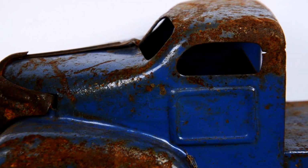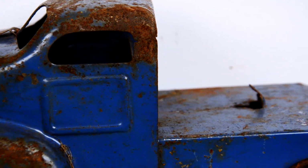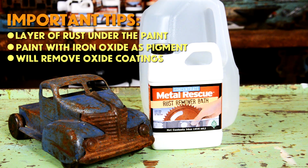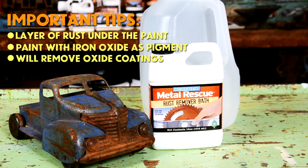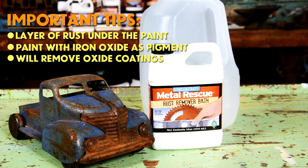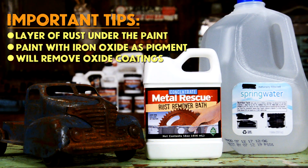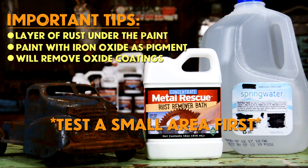That's it. Now with that said, there are a few exceptions when soaking a painted item in Metal Rescue. Couple tips for you. Metal Rescue won't remove or harm the vast majority of paint coatings. However, if there's a layer of rust underneath the paint, some of the paint coating will be lost as Metal Rescue removes the rust. Also, some paints and inks may use iron oxide as pigment, usually orange or red. Since Metal Rescue has been engineered to remove iron oxide, it may dissolve the pigment in these types of paints. It's always best to test a small section or hidden area prior to use.